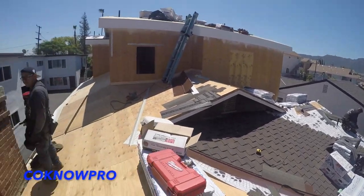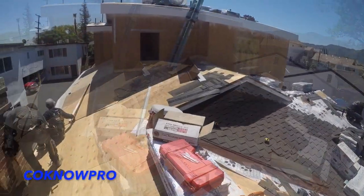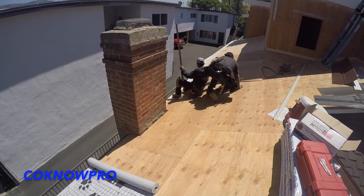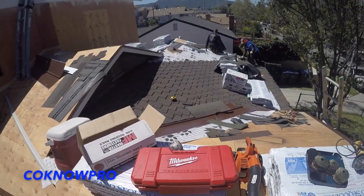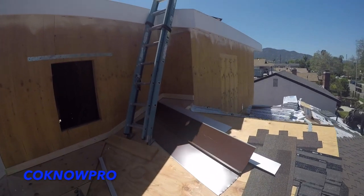You want the roofing to be the last thing that's done — it's the cherry on the cake. We'll have the paper ran up to the house so they can do the stucco. Remember, there's some one-by-four that you have to wrap around that whole vertical section of your framing, and then install Z-bar flashing on top of your paper before the stucco gets done.